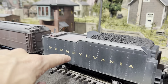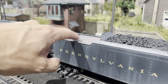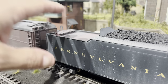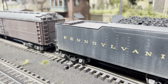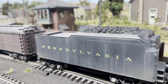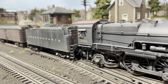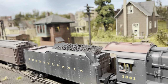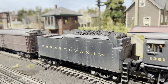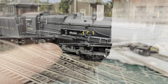One thing you can't see is I also went through the trouble of adding a single Lionel Fatboy. It's an 8-ohm Fatboy. Sounds so much better. I got the sound volume out of it. I went through all the trouble to make a 3D printed speaker enclosure, and I never got the volume levels out of this that I wanted. So this is running with EOB. It actually uses the classic Lionel heavy-duty rail sounds power supply. So it should sound better than the stuff that Third Rail puts in there, and sure enough, it did. Once I got the Lionel Fatboy in there, this thing sounds pretty cool, as you could hear in that little running montage. So anyway, let's get to it.